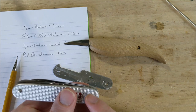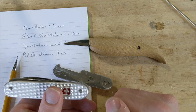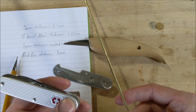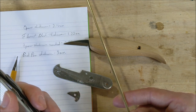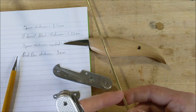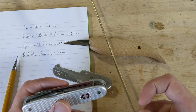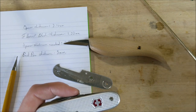I'll have to put a new rivet in and peen it so it stays closed. These rivets are silver — I forget what they're made out of — but I don't have that material. I have a brass rod which is slightly oversized; the pins are three millimeters thick and this brass rod is an eighth inch, so I'll just put it in a drill and sand it down to three millimeters. Hopefully it'll be strong enough; worst case I'll just replace it after a while.